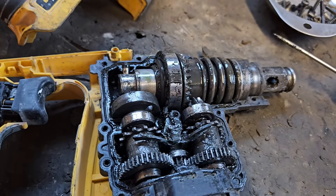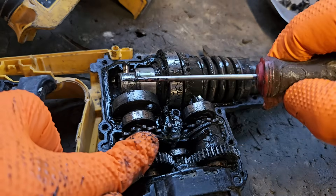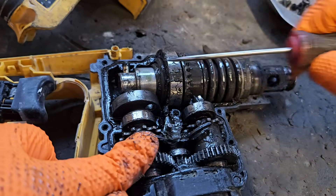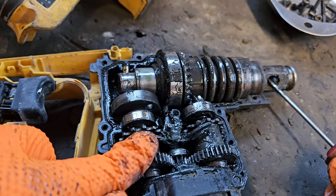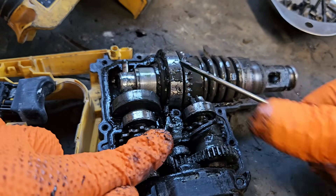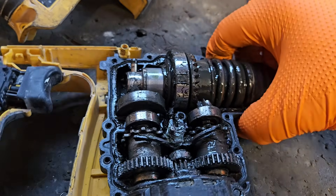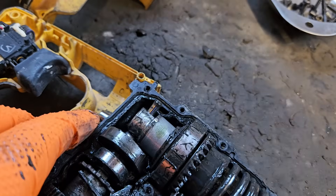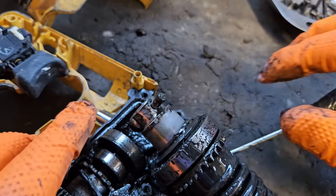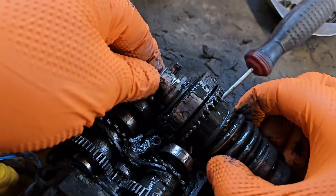So that gives you your hammer drilling - that's the main function of this machine. So what that does, when that rotates, it puts this piston in and out, this slider in and out, and hammers at the front here, and causes the hammer effect. This just rotates the cylinder. It's quite simple. And how that works is, there's actually a ball here. The ball's out of place. I'll show you here, I'll pull this out so you see what's going on.